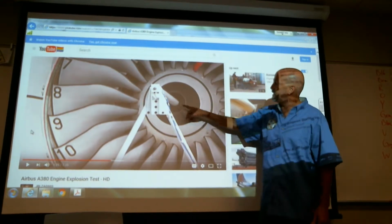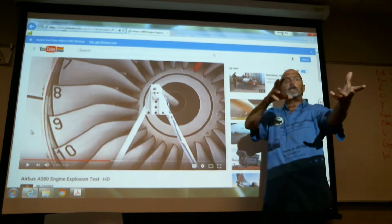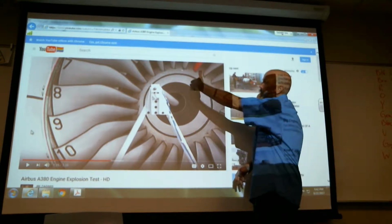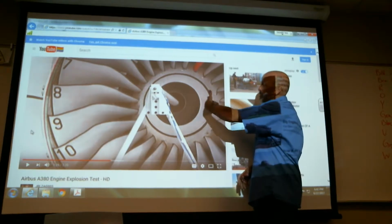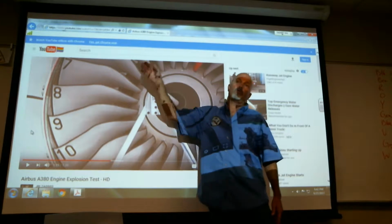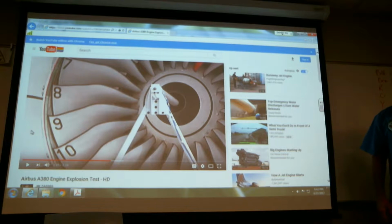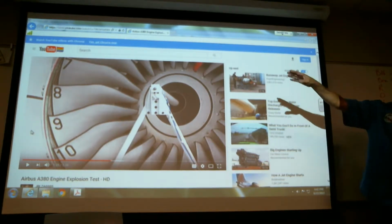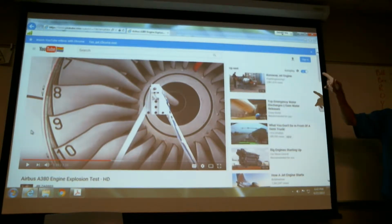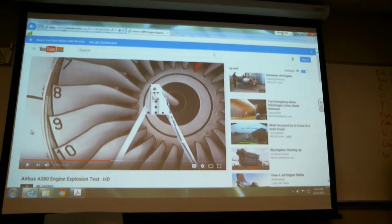And the cone on here, this is an incomplete cone. They do design these cones as best they can, so that if material is carried in towards the center here, the cone is supposed to deflect it past the engine inlet and direct it into the cold airstream to keep it out, because it would destroy that engine. If they can get it into the cold airstream, it's going to do very little damage, maybe to a blade, but it'll be flying within hours. But if it gets into that compressor, then you're talking millions of dollars in repairs.